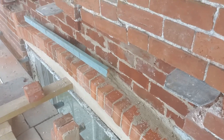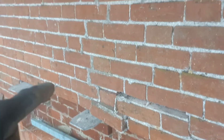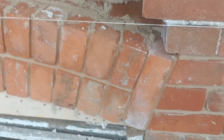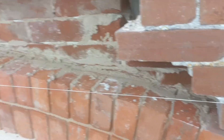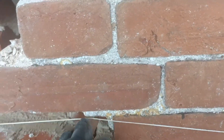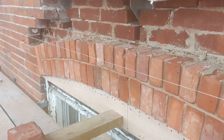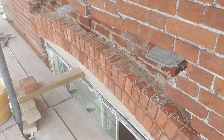Then get the creepers over, and once the creepers are done just quickly brick up, get these bits out here, slate it all up ready to cut these out and get helibar in later on. Just done the second ring over there, just raked it out ready for when the repointers come, because this whole gable — the whole building — is being raked out and repointed. Next will be cutting the creepers in, and then we'll see how this all works with the coursing and that line up there. Carry on — creepers and brick another.